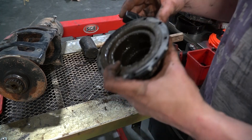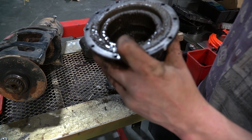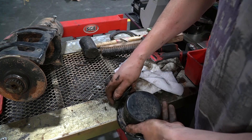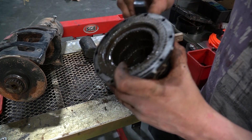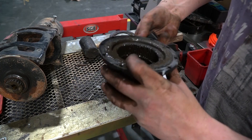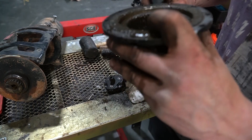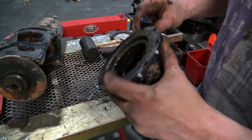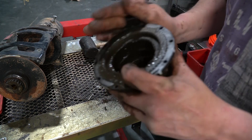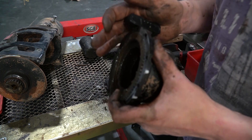Now this is the bit that I'm mostly concerned with. This is the bit that engages and disengages the spool. And as you can see, it's still not turning. But if you give it a whack, it kind of works. So that's just going to be a case of strip it, clean it, degrease it. But it almost feels like it's cocking over on one side, like when you tap in a bearing too much on one side. So this could be a little bit more sinister. We'll see.